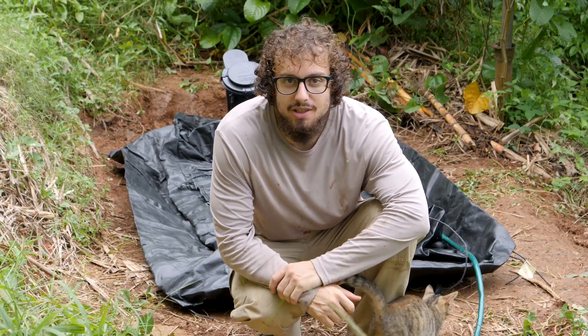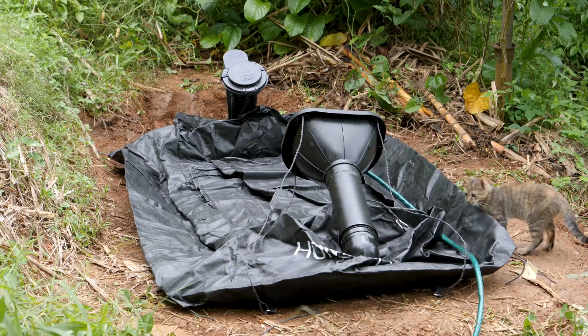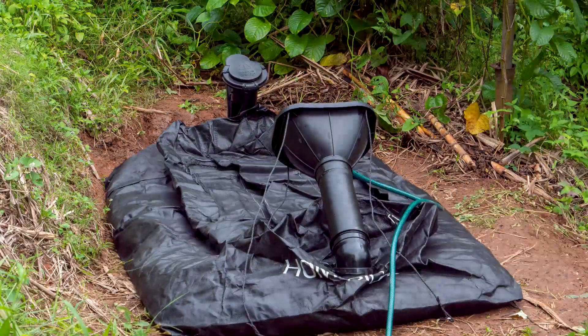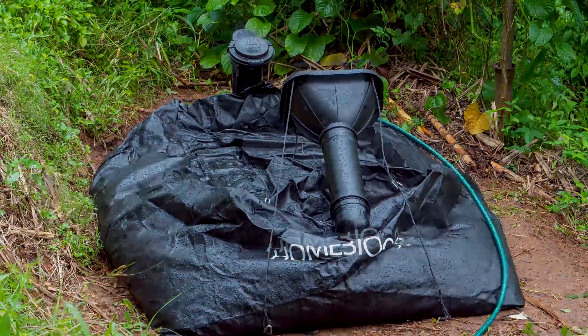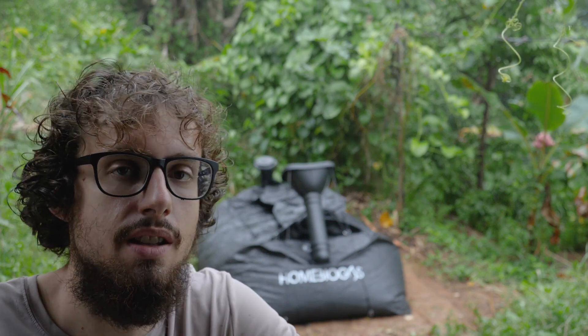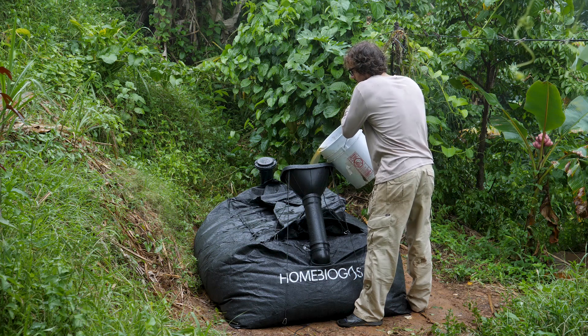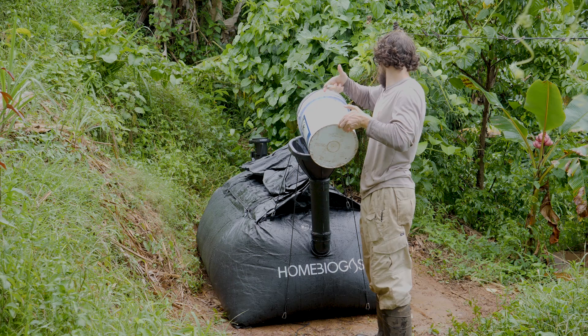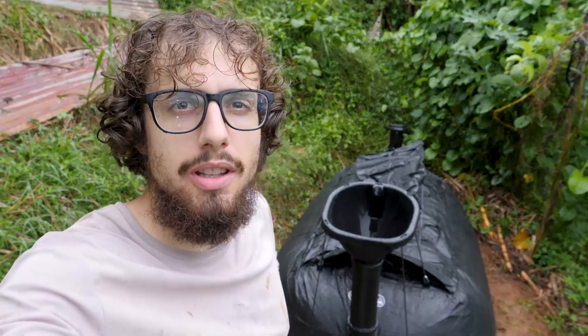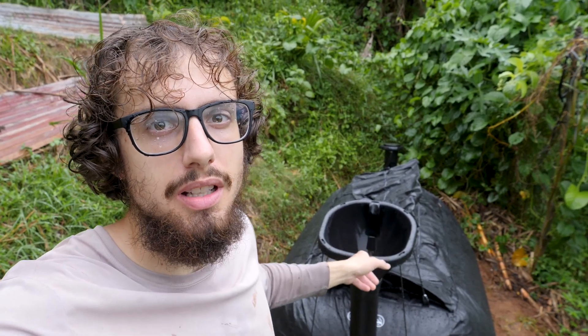So now it's about the moment of truth — about to turn the water on. While the biogas digester is filling with water, check it periodically to make sure that everything is unfolding correctly. I've got the biogas mostly full, and now I'm going to fill it the rest of the way with some old effluent from a biogas digester that has already produced methane, so we know it has the bacteria that can produce the flammable gas. After putting the last bucket in, it started leaking out the other side and that's how I know it's full.